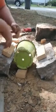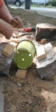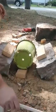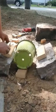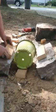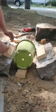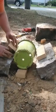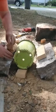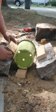and those would work great if you want to do a dry stone bridge or not use any mortar. But if you're using natural stone like I did, it's really hard to get that perfect angle, so I used mortar. Right here I'm going to simulate the mortar using these shims. So you would take your block, put down some mortar, smash your block into that, and then lay down another layer of mortar, which is this shim here, and put your next block, or your next couple of blocks, depending on how wide you need it to be.